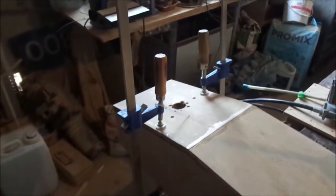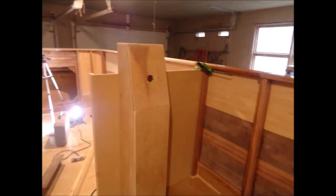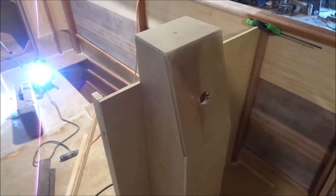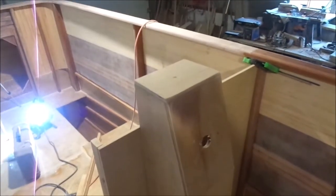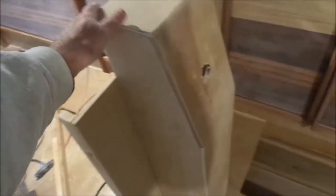This is the steering console so far. I've got the hole cut into it for the steering wheel mounting plate. I'm going to finish epoxying this down in the basement — it's too cold in the garage for epoxying right now. Here's my steering wheel column that will support the steering wheel mechanism. You can see that it is higher than the edge railing system, and because I'm planning on using a canopy that will collapse right to the railing system for transportation, the steering wheel on it will be too high, so what I have done is I have hinged it.